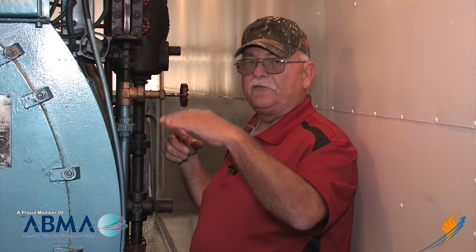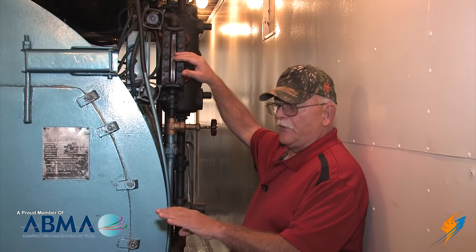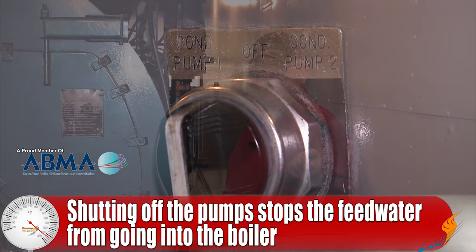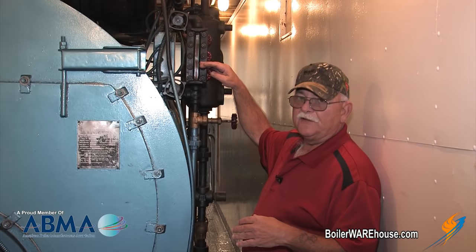So if you had your normal water level in your boiler, with your burner running less than 50% to low fire, you're still producing some steam. You would go and shut off your pump. Once you shut off your pump, stopping the flow of water to the boiler, you would let the water level fall naturally. It will just steadily keep dropping because you're not replacing any of it.